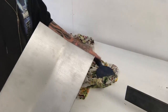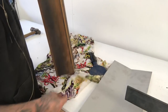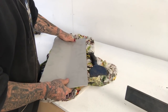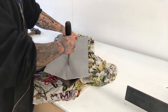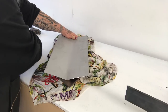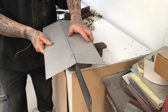Normally for using this, I'd mark both sides of the angle, open the jaws of the vise about 100mm so this can sit in it that way, and literally sit the piece hovering inside the angle. Then just use the bolster on my line and tap it as I go. It's not really appropriate for this job, so I might just do another demonstration of it later, on a piece that doesn't need a rounder radius on it. For now we'll just go to this piece of flat bar.